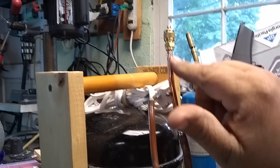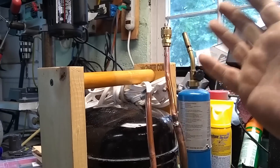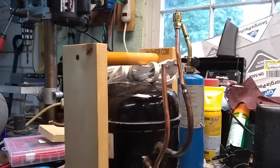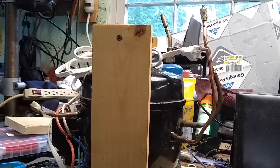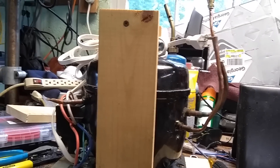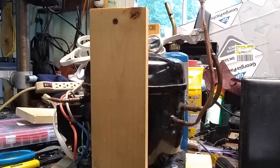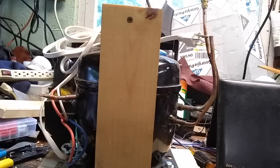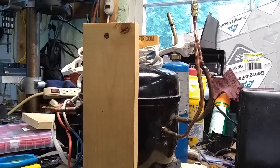It was an old refrigerator somebody was throwing away — I ripped the compressor out of it, I got the starting capacitor too — don't forget to get that. I used an old extension cord for the power cord, and you could probably cut the power cord off the fridge too. A little bit of heat shrink and some connectors, and just some scrap wood I had laying around to build a little carrying frame. The only thing I really had to buy was this fitting from Hong Kong or China on eBay — I'll put a link below. That was like a dollar or something shipped, so nothing there. They call those AC service ports if you're looking for them online. Now when I need to work on an AC system and vac it down, I don't have to have a big noisy Venturi Harbor Freight vacuum pump that runs the crap out of my air compressor. Also with this being quiet, if you have a little leak somewhere you might be able to hear it when it's vaccing down — with that Venturi one going, you can't hear nothing. So you don't have to go spend $150 on one — you can build your own. And if it burns up, there's plenty of more refrigerators out there that you can probably steal a compressor out of.